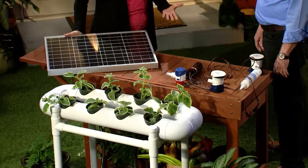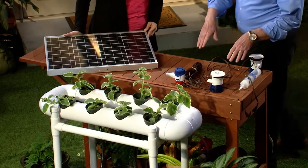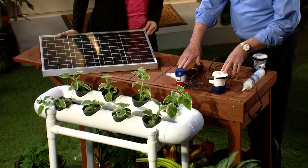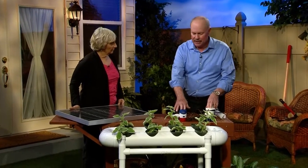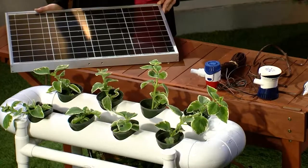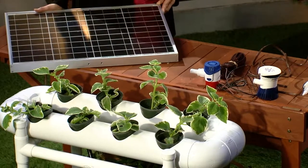So tell me a little bit how we would set that up and then operate it. The first thing you do is buy a marine bilge pump from a boat store that handles boat parts, and you look at the amps and the voltage on the pump. Then you go buy the solar panel — you want one with a similar amperage and voltage as the pump. The amps are recommended to be a little bit lower on the solar panel, but the voltage could be higher or lower, either one. If it's higher, then you want to put a damper or resistor in the line from the solar panel to the pump, so when the sun's at full strength in the middle of the day, it doesn't send too much power to the pump. That's basically how you make your choices.